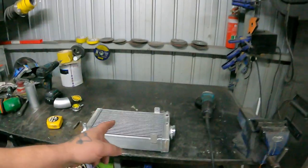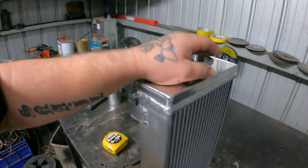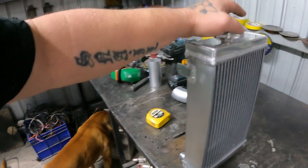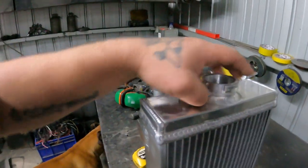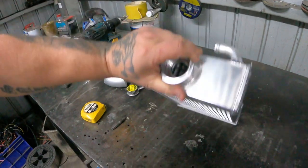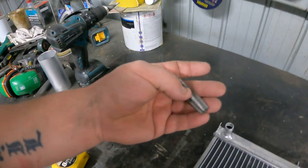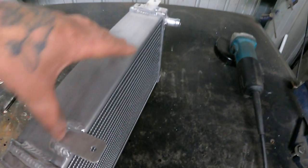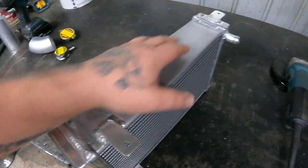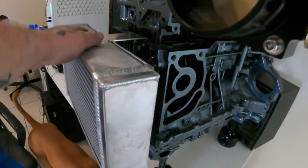We have the radiator for the PC build. Because it's going to be mounted sideways I need to cut off the filler and use it as a heat exchanger, not a radiator. I'll cut the neck off, re-weld it smooth like the other side, cut off the existing fittings, weld them up, and tap them with a quarter-inch fitting. Then I'll make a couple of brackets to mount onto the engine.